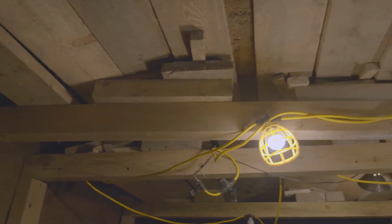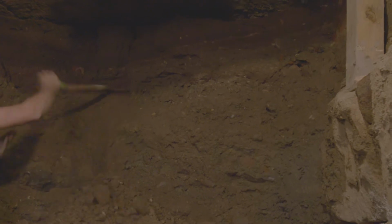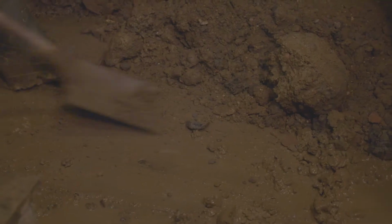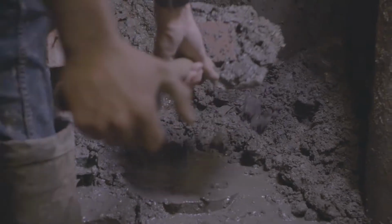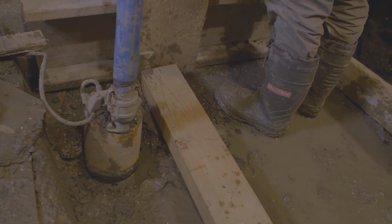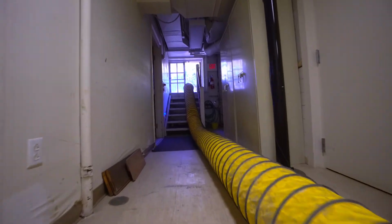Pit underpinning is a series of small excavations similar to those exploratory excavations that allow you to go down and expose the wood piles. It's all dug by hand, so you have a series of 5 or 6 guys that are digging a hole, bracing the hole as you go deeper with timbers so that people can get inside and do the work as you get deeper. You've got pumps that have to pump groundwater because we have to go below the groundwater table to get to an elevation that we can cut the piles.